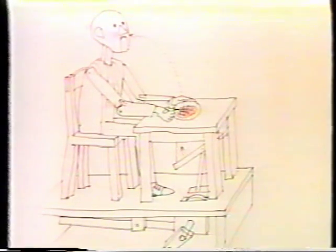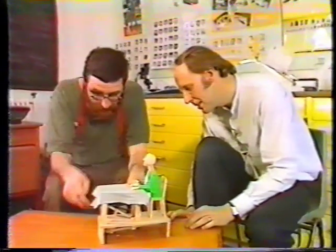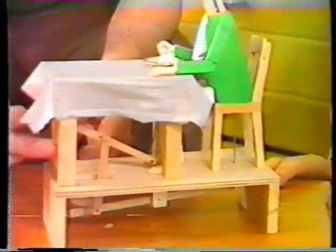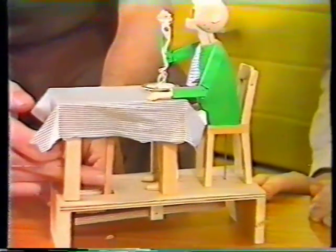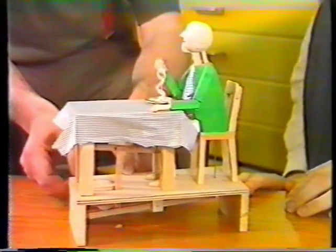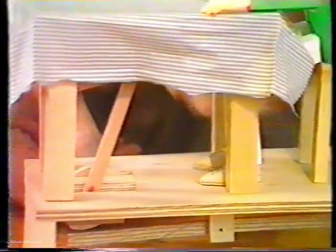Perhaps Paul, could you run us through some of the points which were particularly tricky to get right? Yes — the trickiest thing to make is a crank, so what I did was make the crank and then adjust everything else to fit it. The connecting rod — if I were a bit wiser I would have made one you could extend and contract to adjust. The point where the connecting rod joins with this lever: I've had a few shots at that, so an adjustable bit there would have been a smart idea. Another thing that's different today is the chewing motion — once spaghetti is in his mouth he then has a little nibble as the fork goes down. I cut a bit of the smoothness out of the movement by slicing a bit off the top of that cam, so there's a slight wiggle to the motion of the push rod, giving a little chewing — it makes it a little bit more interesting.